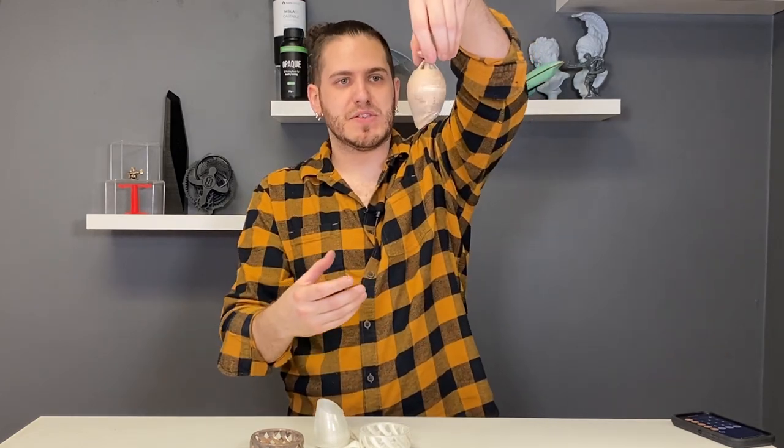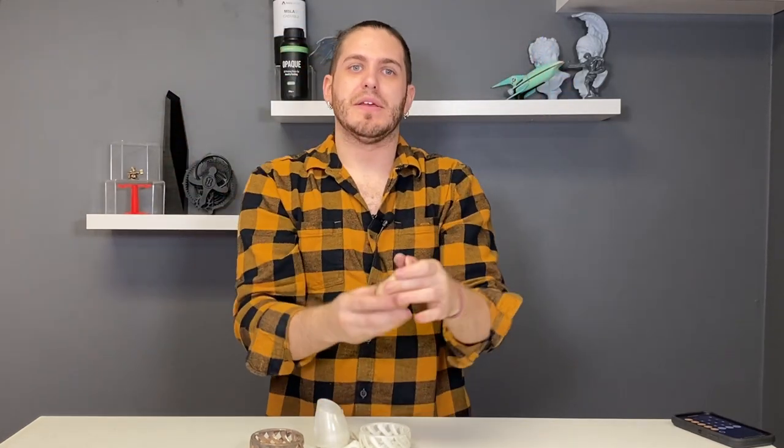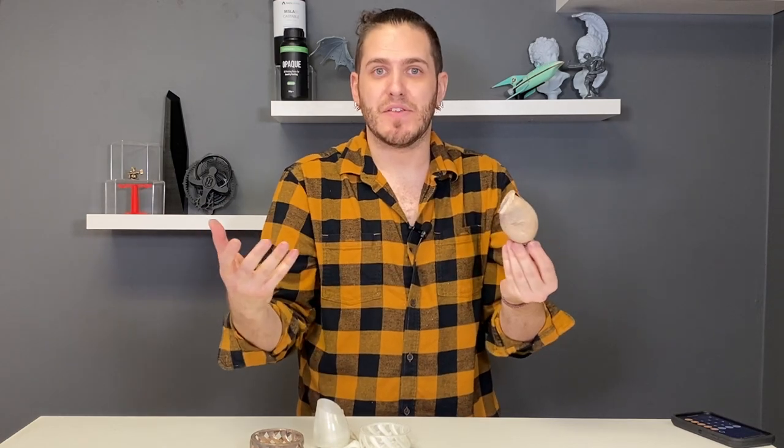We have done a cast overnight for the Polymaker Cast Filament, and we had some mixed results. The bad side — which was actually my fault — is that I've never really done this before and we tried doing a hollow vessel. As you can see, the cast did not get all the way around and it filled up on the top. What was supposed to happen is the metal gets poured in and goes all the way around the core of the hollow vessel. But in the burnout, the lip of the vase wasn't strong enough to hold the investment core, it broke off, dropped to the bottom, leaned against one side, and we got an incomplete fill.